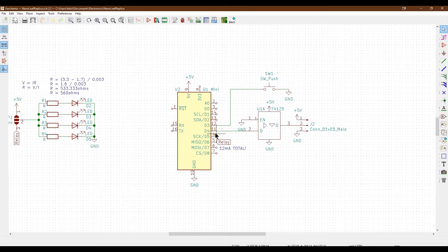Pin D4 goes into the non-inverting buffer. There are four buffers within the chip that we're using as a quad buffer and they've all got individual enable pins. These are again active-low so they need to be held to ground in order to activate the buffer. This particular one I've hardwired down to ground meaning it's going to be active the entire time. The data pin comes from the mini and then into the buffer and then goes out to the LEDs on the other side.